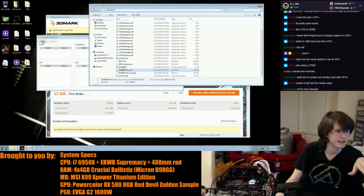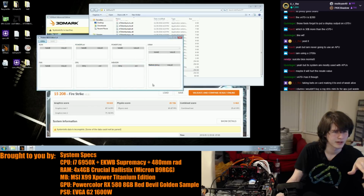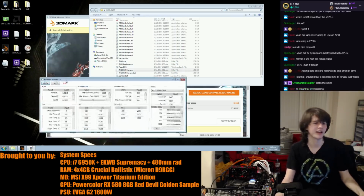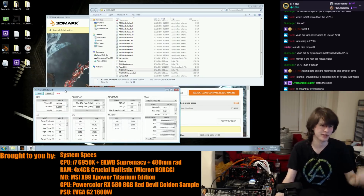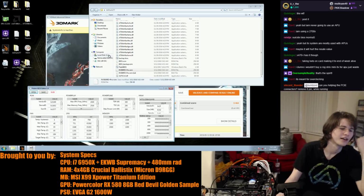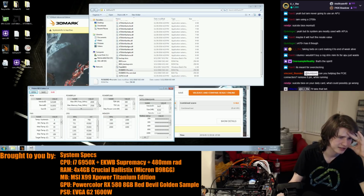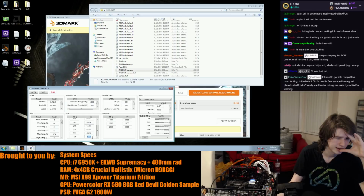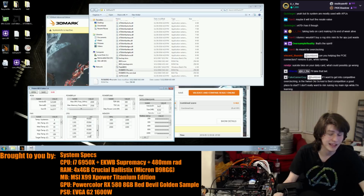And let's see, open that one. Oh, right. You know what's really funny? ATI Flash apparently fixes the checksum for you when you flash the BIOS, but for some reason, Polaris BIOS Editor gets really triggered. I've never seen a use in fixing the checksum. I've never bothered to do that. Anyway, what I want to do is make a suicide BIOS, so we're going to go to like 1300. I think that's where the limit is. I don't think you can actually set anything higher than that.